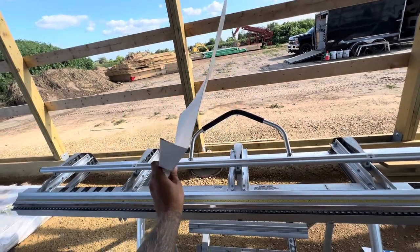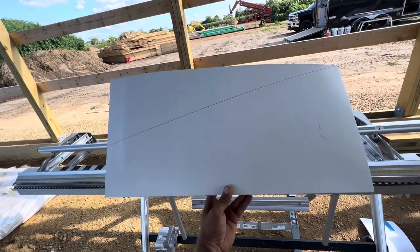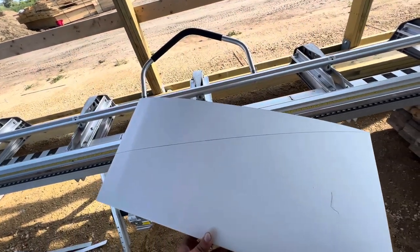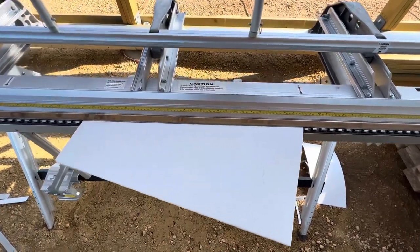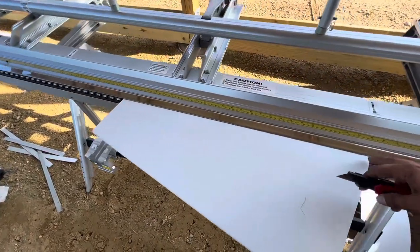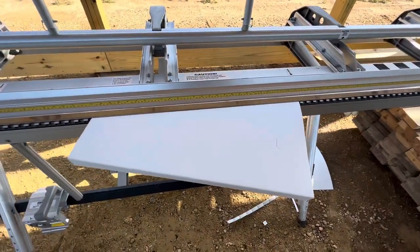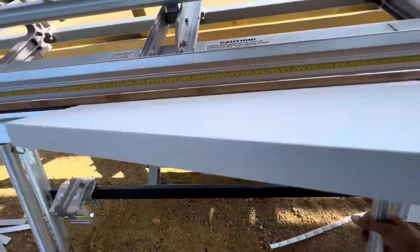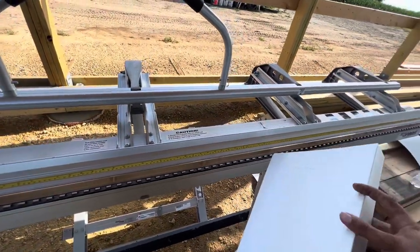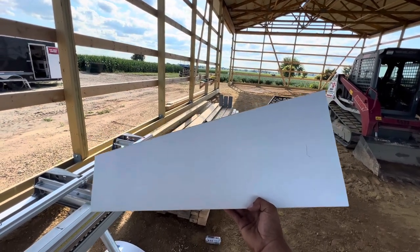Basically just made a 12-inch piece of fascia. We did our three-quarter hem and our inch-and-a-half to match the fascia on the building, and then we've got this line which goes from five on the left side up to the corner at 12. I find the easiest way to cut this — because the cutoff tool has an inch-and-a-half offset — is to put it in on the line, take a new razor blade, give it a score, and then fold it back and forth a time or two and it snaps off. Now we have our piece. Let's take it up in the air, do some modifications, and get her installed.